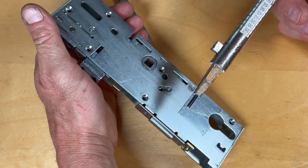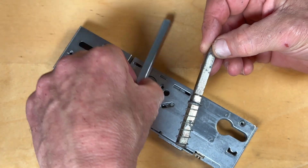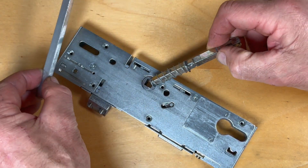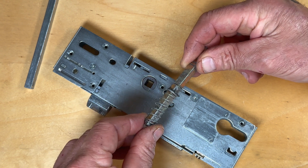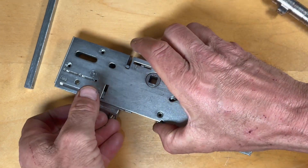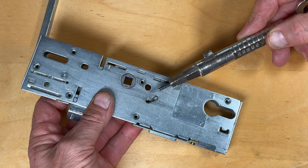Now I'm not trying to teach you to suck eggs here, but the other configuration you're going to have with this is what's called a split spindle. This particular spindle, compared to the solid version, actually rotates about the middle so each half of it can rotate separately. When that's positioned inside this centre case, one half of it will operate one side of the lock and the other half will operate the other side. What does that allow you to do? With just one handle you don't need to have a separate paddle as you would have on a dual follower on a centre case.